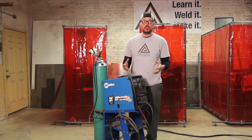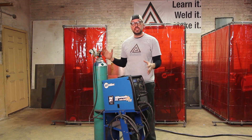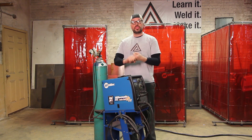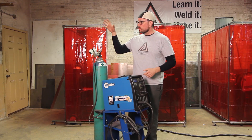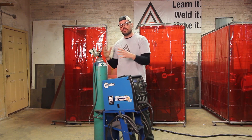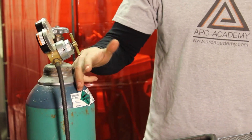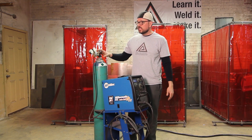So how does welding work? As a welder, you're setting your entire system in accordance to the thickness of the material you're welding on — all three elements. First and foremost, we want to set our shield gas. For inert gas processes, your flux is replaced by a shield gas. For carbon steel, you want to use 75% argon, 25% CO2.